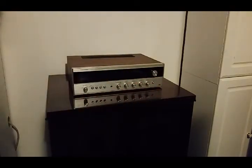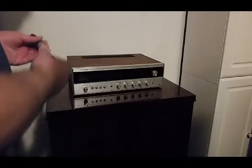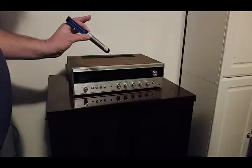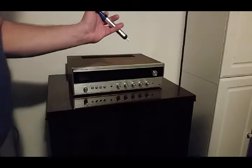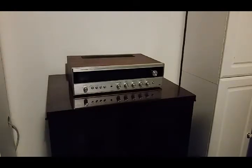It sounds good now. Just a quick note — two things I would do differently next time: when I was trying to unsolder the transistors, I did not use my solder sucker tool to remove solder from the joint. I just heated it up and tried to pull it out with some pliers — that's why that copper ribbon pulled up. Next time I'm going to use the solder sucker — just hit the plunger as it's warm and it pulls the solder right out. Also, make sure you don't burn up any wires near the circuit. Thanks for watching, hope this helps, and see you next time.